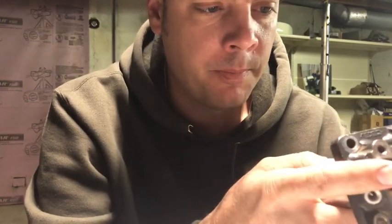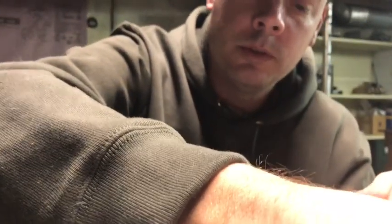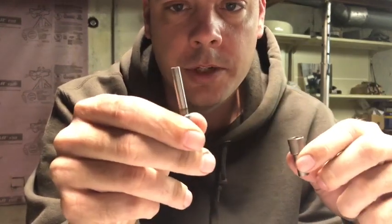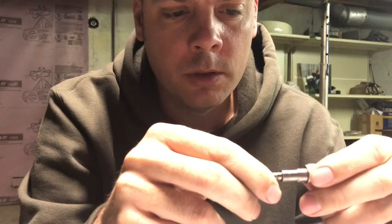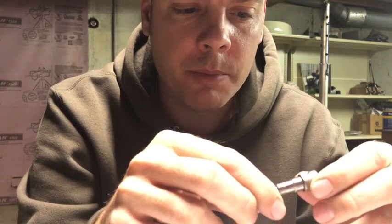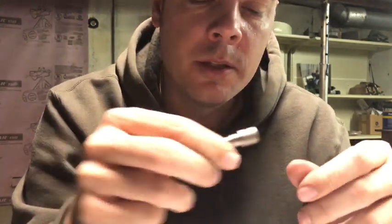What an injection pump does — essentially, I would say an injection pump is a lot like a motor. You've got your barrels and plungers which compress fuel and force it through the injectors. This pump came to me with these stuck. Poor fuel quality and water sitting for a while caused the barrel and plunger to basically seize up. It had a drag in it, and cleaning it, soaking it, doing different things to try to get it to work.